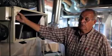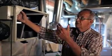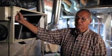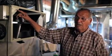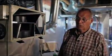That's the fan blades that I talked about. This is the safety switch. So when the door's off, this machine won't run. Like I said before, if the machine hasn't been cleaned very often, this will stick. So you take the door off, and the machine's still running. This is how we can test it later on, to see to it that everything is going to work.